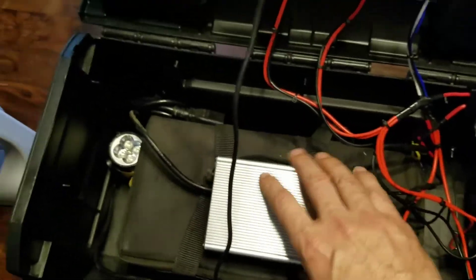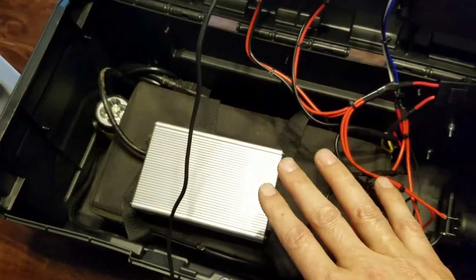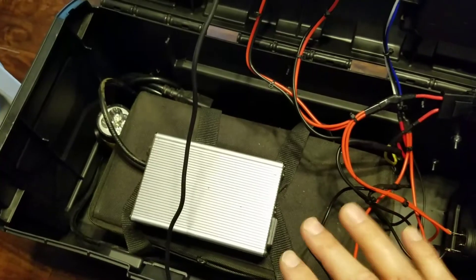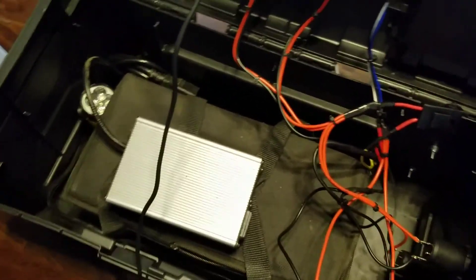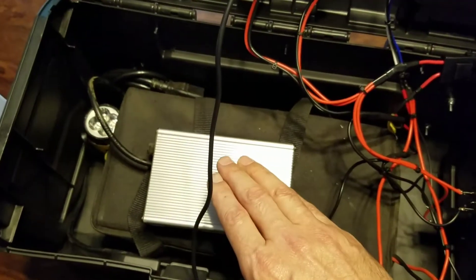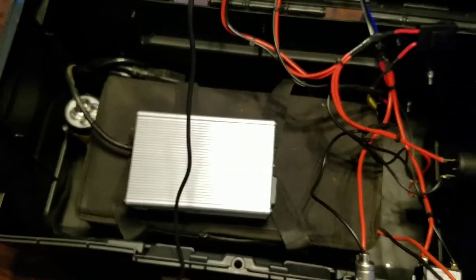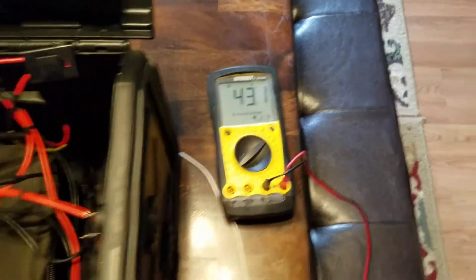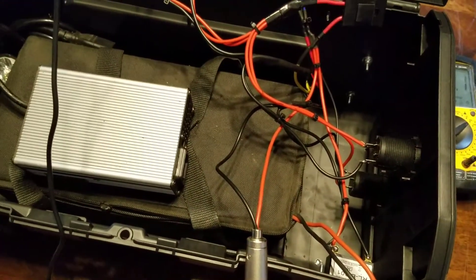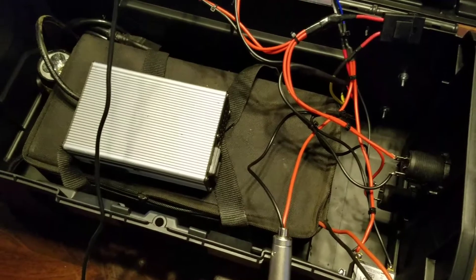This is the charger for the battery — if you're in a remote location and can find a wall outlet, you can charge it up in about six to eight hours. It's a 36-volt, 2-amp charger, so it takes six to eight hours from dead. The battery is currently sitting at 43.1 volts. My son rode his scooter for at least a few miles the other day.